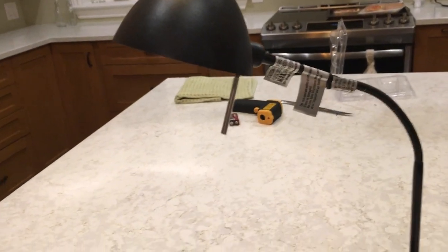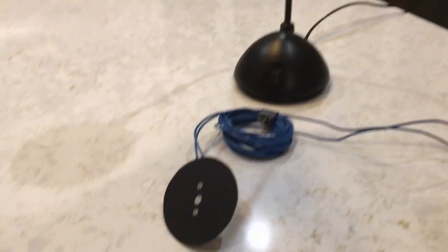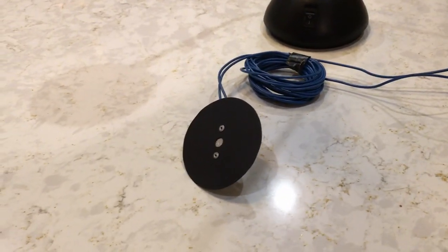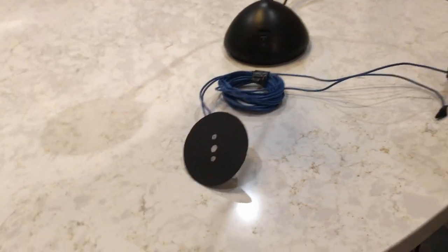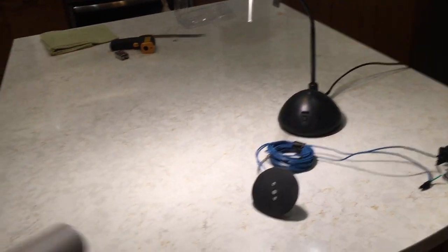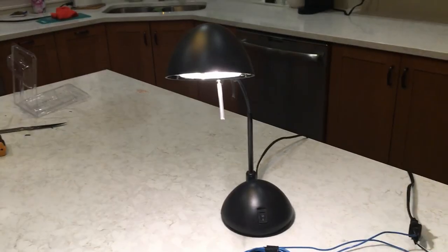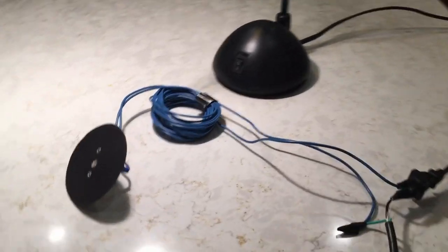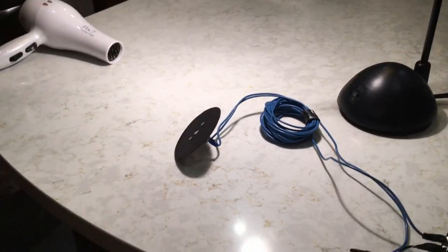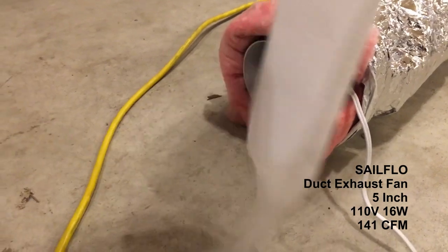This switch, set to close at 35 Celsius, only provides current to the fan if the interior chamber reaches 35 Celsius. In reality, you want the fan to be running anytime the interior of the solar air heater is warmer than the building. This calls for a temperature differential switch or a thermostatic switch that can be controlled. So, although a bimetal snap switch is a good solution, you'll see in a little bit what I ended up using.